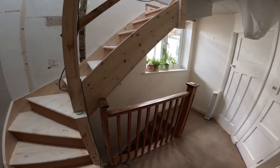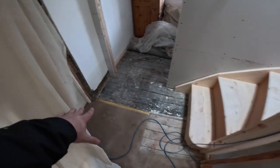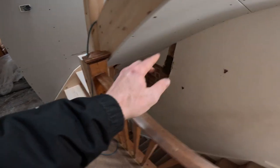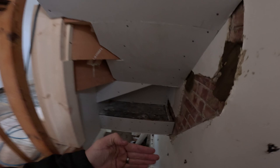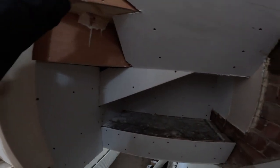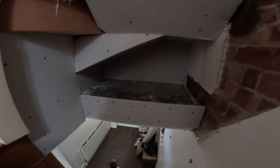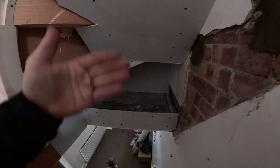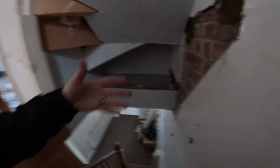I'll switch the camera around and show you where we're at. This is the original layout of the front box bedroom — you can see the carpet, and this is where the door was originally. What we've done is moved that wall over slightly to give us space for the staircase and enable the head height up and over the existing. One of the main factors we have to be very conscious of is the head height as we're going down the stairs, so you'll see here we're going to have to create a little bit of a winder.